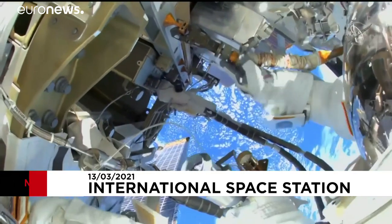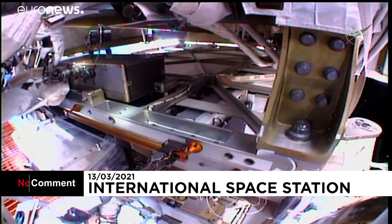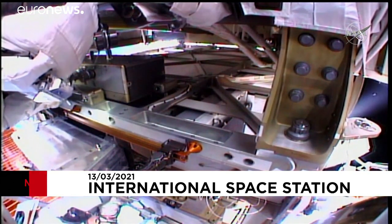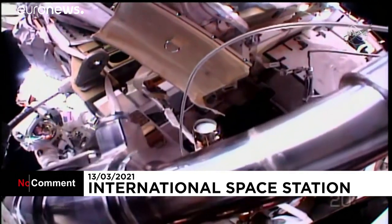Okay, let's go ahead and mate that hopper so you can mate the QD extender to the vent tool adapter. Okay, that's a good config — the QD is closed as expected. Verify that it's ready to mate; check that the detent button is up and the forward white band is not visible.